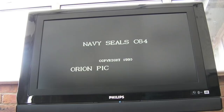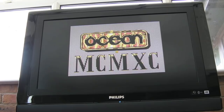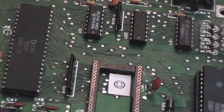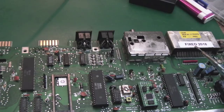You know, this board has been sat around for about six months at least, but when I originally looked at it I compared the pinouts and I think they were pretty much the same between these two PLAs - it's just the colour and SRAM arrangement that's different. I couldn't resist sticking a little smile under there actually, just in case anybody ever removes the PLA here, to draw their attention to that damage. And I did mark the board - I'm going to start doing this with all the things I repair. I've done many things in the past where I stuck a label on to say what's been done or if there's a mod in there. Anyway, hopefully you found that interesting - thanks for watching, I'll see you soon.